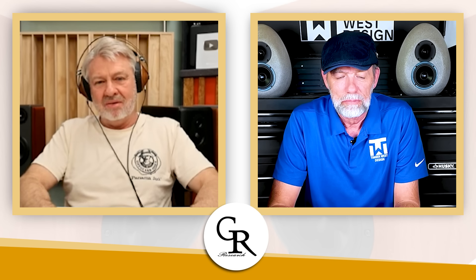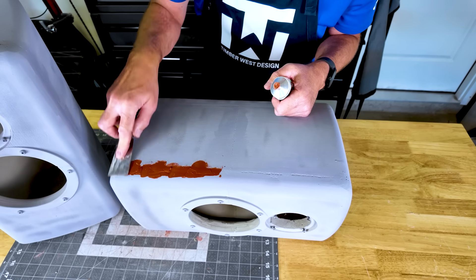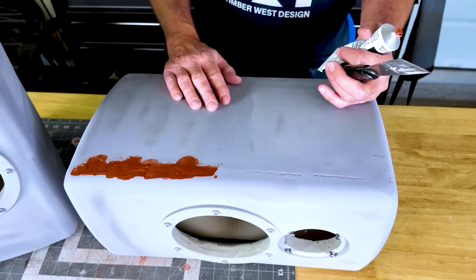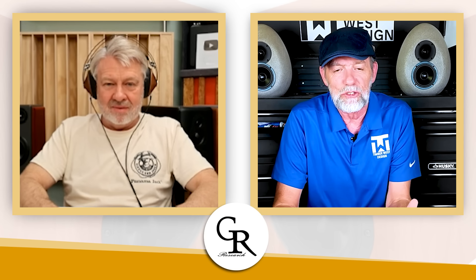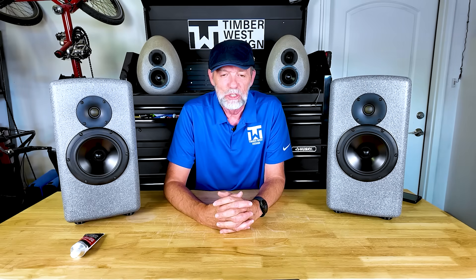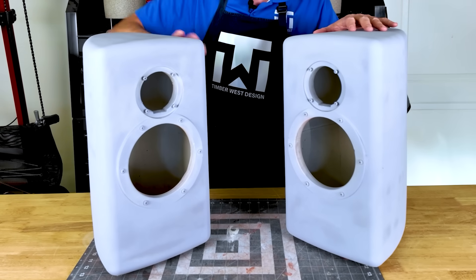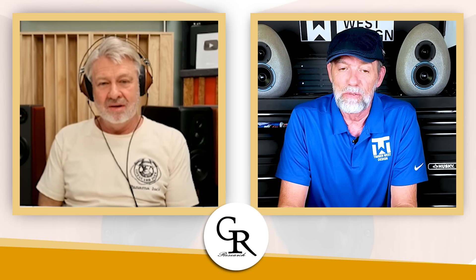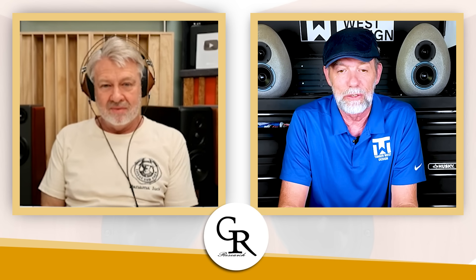What was the material you smeared across the outside, almost like you were putting Bondo over the seam? I use Bondo spot putty — it just fills imperfections after you prime it. You can really see the flaws after you prime it, and in a lot of cases I can just do that and then paint from there. In this case I primed it a second time just to get it nice. I noticed you sanded the whole thing down with 150 grit — so when I'm sanding 150, I'm sanding the primer, not the concrete itself. We're not getting into the concrete anymore.